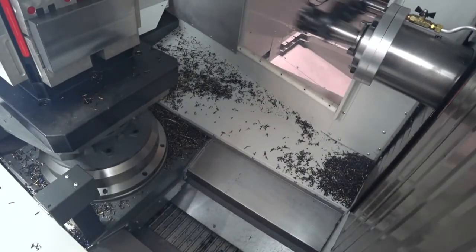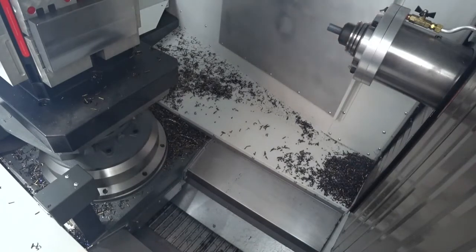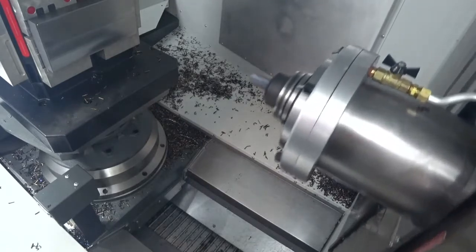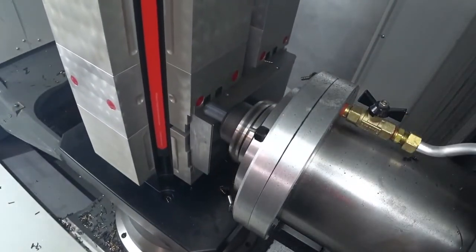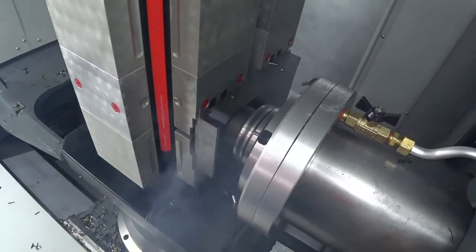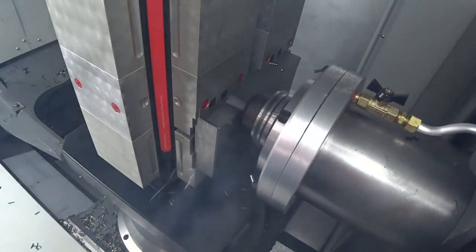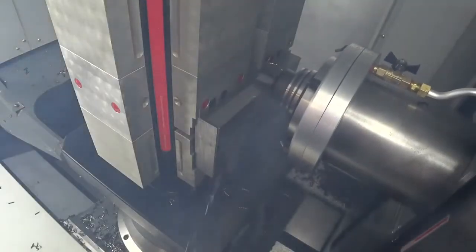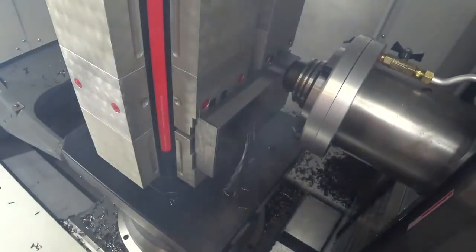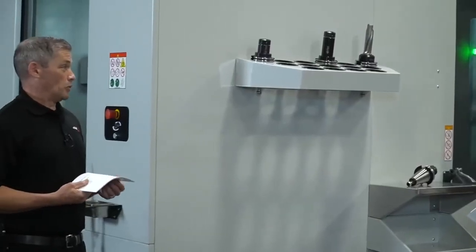You'll see if you glance at the spindle load when we go to the full slot. I programmed that up to about 120% spindle load, and actually you could run like that all day. You can do 15 minutes at 150% spindle load on our machines. So 120% is an all-day sort of cut, and you'll see those chips fly. It makes short work of this block. If you're at 150% for 15 minutes, that's a boatload of chips right there.